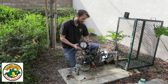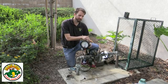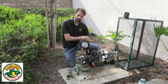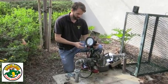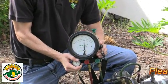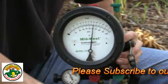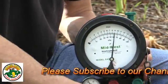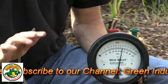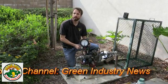For the final check, I reset the check valve one more time by bleeding the low side and closing it. I observe the value — I'm still at 9 PSI. That's my actual differential pressure drop across my check valve, meaning this number one check valve is holding back 9 PSI. We need a minimum of five, so we have a nice strong number one check valve. This backflow passed.